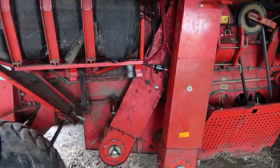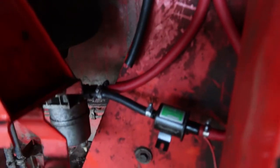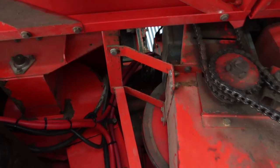Okay, so that's the new fuel lines installed. So basically you have an outlet and return on the tank. Down here, sediment bowl. Back up to the engine. I left the little clickety-clack pump here for the moment, and throw some power on that rather than cranking the engine over, and get the diesel up to the filter.